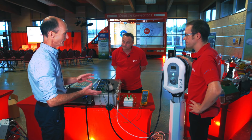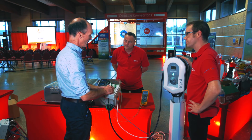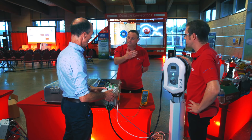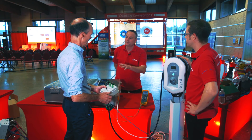This is why we developed a device that would make it safe in every single circumstance — not after four seconds, not after five seconds. If there's a fault current flowing through this path, through your person washing the car, then we'll trip and make it safe. When we say trip, we're going to operate — it's equivalent to an RCD, but it's not an RCD. It's a different measurement of fault currents flowing through this path, and then it will completely isolate your vehicle: your live, your neutral, your pilot earth. All those connections will be disconnected and isolated. That's why when you opened it up, there wasn't an RCD — it was the electronic components disconnecting the circuit.